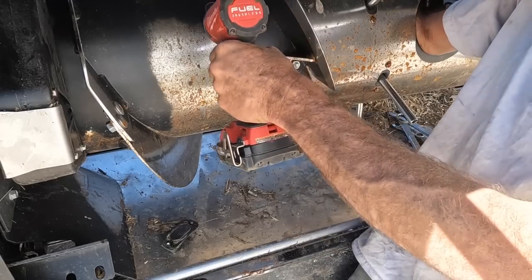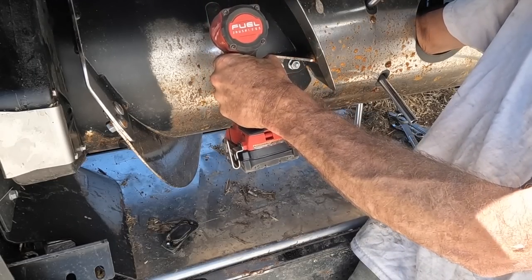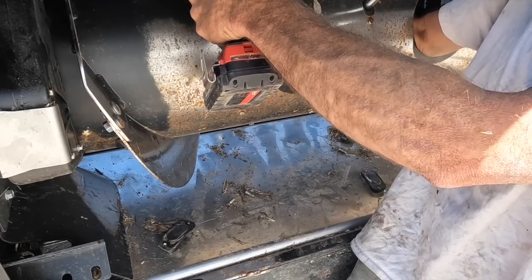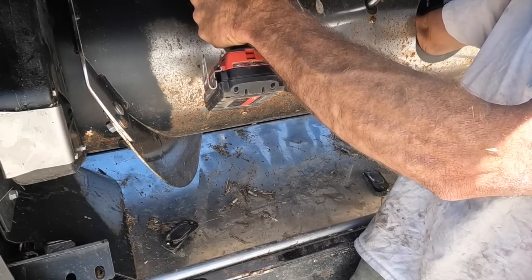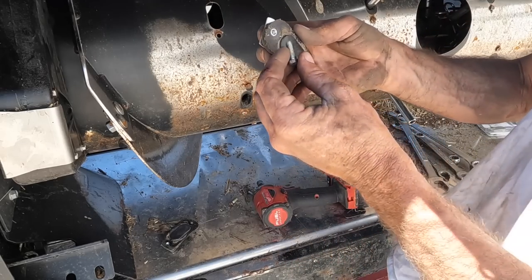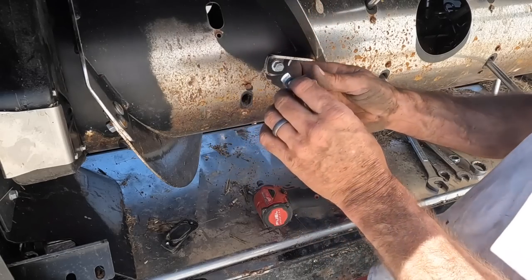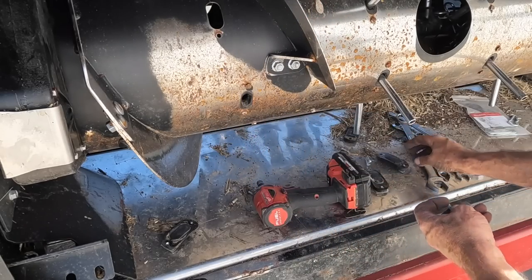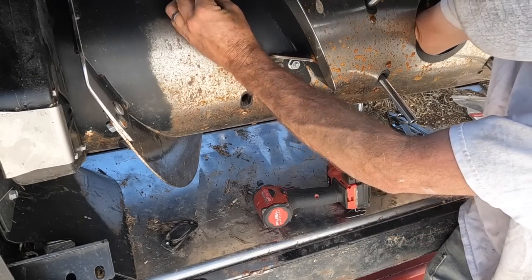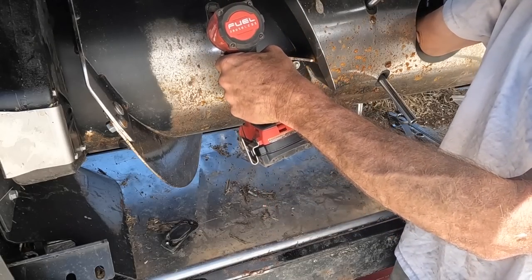And that's how you put one in, here's how you take one out. You do have to be careful because these T-nuts, as you're doing this, sometimes want to push through and then they'll spin. I'll show you. So sometimes as you're pushing with the nut, it'll spin, and if your finger's right there, that hurts. I have found from experience. The new one.